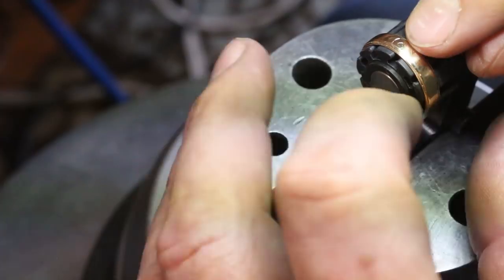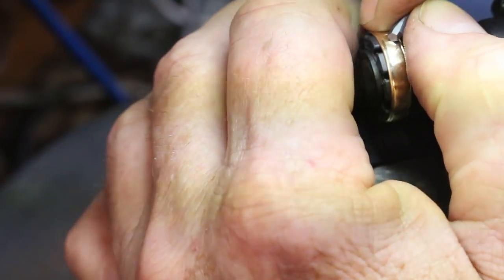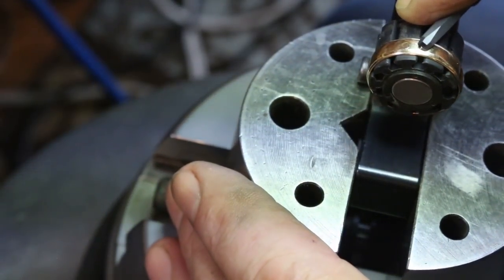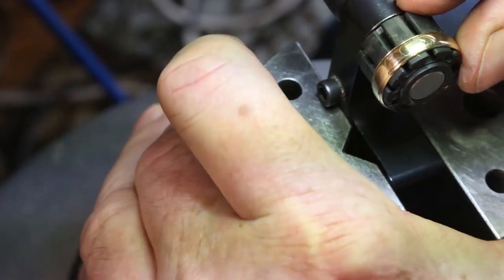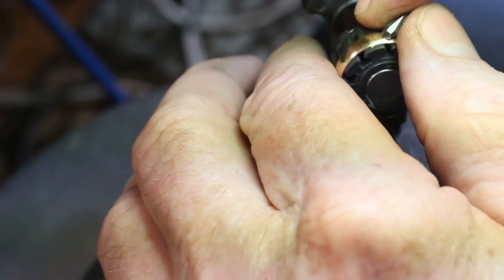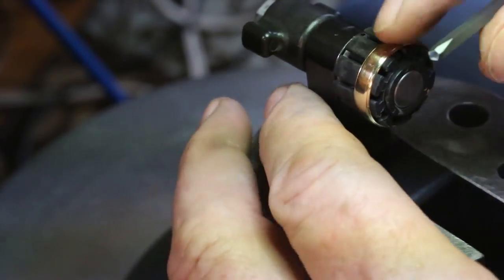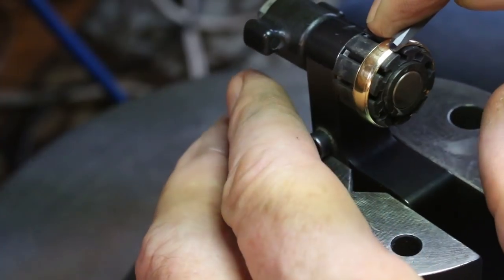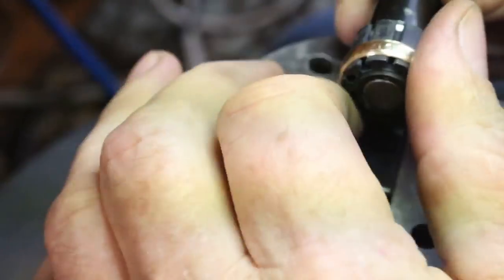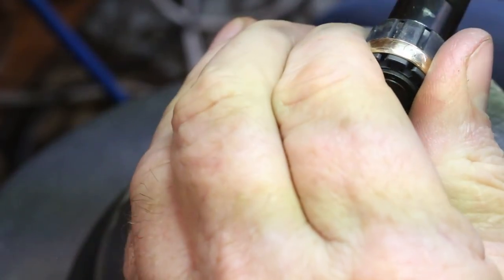If you just have laid them out flat, one next to the other, all the way around the ring, it's going to be very flat, not very lifelike. It's just going to look amateurish. So when you lay out your engraving, and I know it's difficult in the beginning, everybody's engravings look flat and two-dimensional at first, but be thinking about what you can do to make your engravings more complex and more lifelike. As I get this line established, you'll see what I mean.